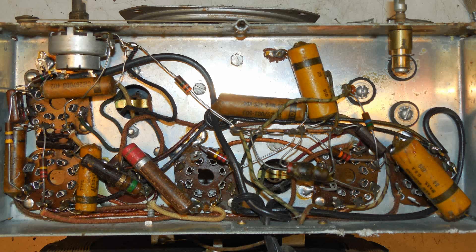The first thing to do is take a look at how the pins on the tube sockets count. Here I've marked the keys on three of the tube sockets. The pin on the right of the key is pin 1, and the pin on the left side is pin 8. So it's going to be very easy to count the pins on these nice big tube sockets.